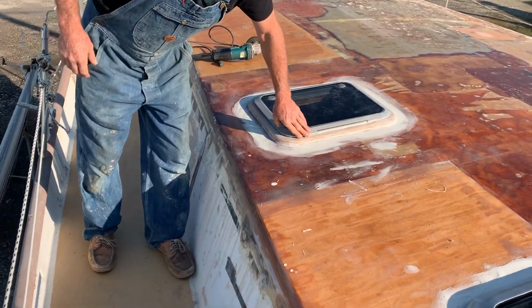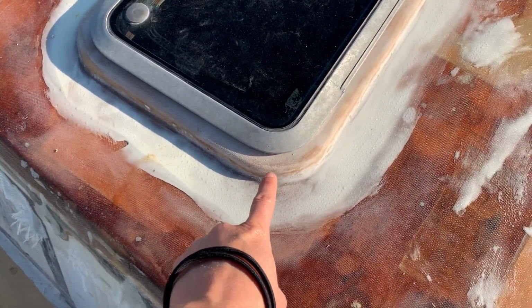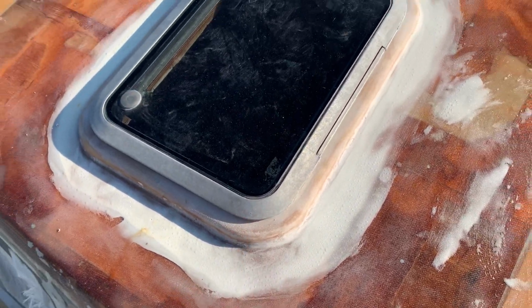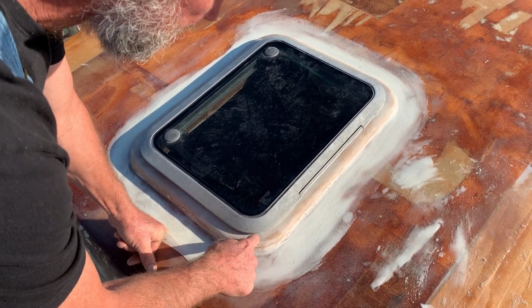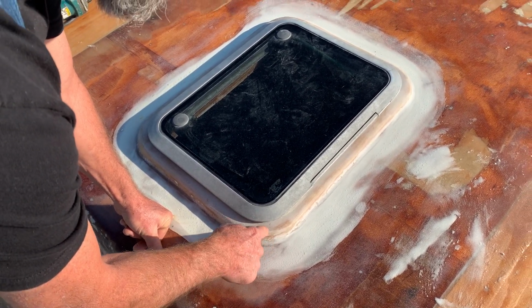Now, are you gonna have to pull the screws out? Nah. They're caulked down, they're good. So these are all made out of foam and fiberglass, glass to the deck, and then faired. The whole reason was these were leaking. Yep. Around here, even though they didn't really caulk them down very well, and in the seams where the wood wasn't very good either, they were leaking.